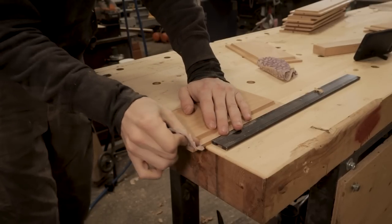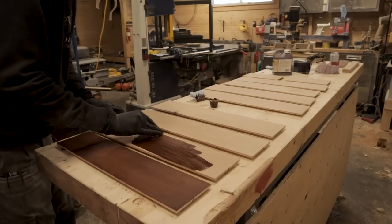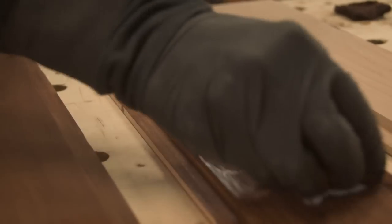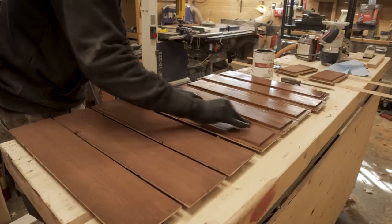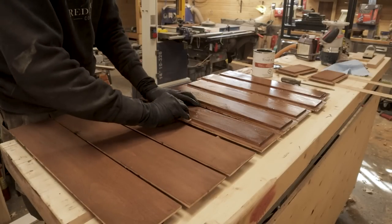But overall, I have to say that I was kind of surprised by this alder because I've never really worked with alder before. I think I've only ever bought one board of it to test out, to play around with, and I didn't really think of any good uses for it because it's such a soft wood. But in the case of this cabinet, where I want it to be a little bit more lightweight because I do plan on hanging it someday, using alder in these cases just helped lighten up the load a little bit. Plus, it actually turned out really well. Now, alder is a wood that does not stain very nicely, but even with this water-based stain that I was using, I was able to get pretty good results.